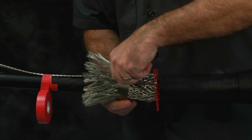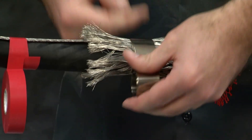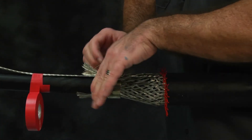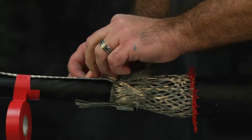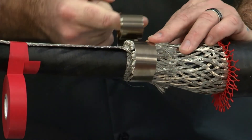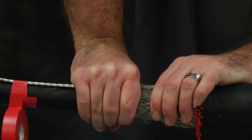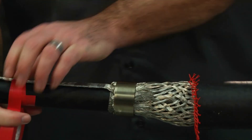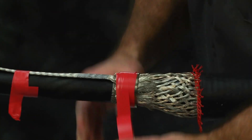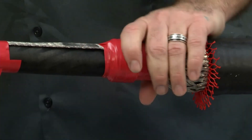Fold splice neutral sock over the braid. Install two turns of spring clamp over the braid-covered metallic shield, external ground braid, and splice mesh sock. Fold the neutral sock over the spring clamp if enough mesh sock is available. Continue to install spring clamp completely. Tighten spring clamp by twisting in the direction of installation. Secure spring clamp with three layers of vinyl tape wrapped in the direction of the spring clamps. Continue taping over ends of the mesh sock wires to cover any sharp points.